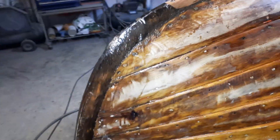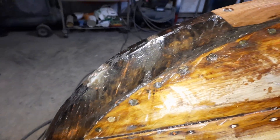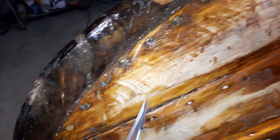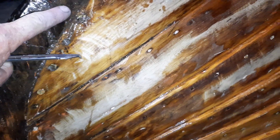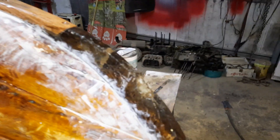Up here on the bow I sanded back the epoxy sawdust putty I had put in — you can see it's all rock solid now. I've gone over it again with more epoxy resin after sanding, because there'll be a very light coat of regular putty on there just to finish it off. That area went from being full of splits and cracks to all bonded together — really solid. That should come up pretty decent.